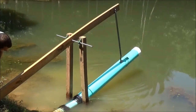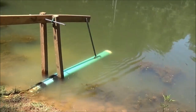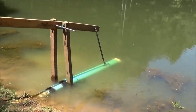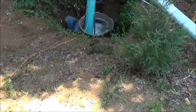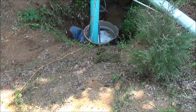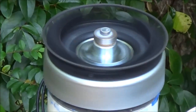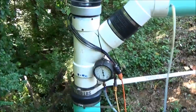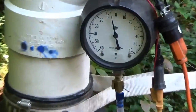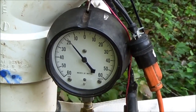Alright, let's get her started. I'm going to lower our gizmo in — just got to push in a little bit and it'll start pulling air, and it just pulled down. When it pulls down like that, the siphon has begun and the turbine will start up. You get a ton of air, of course, a lot of pipe, and the speed's increasing. I don't know if you can hear the increase in sound — we don't have a full siphon yet. You know when the siphon fully develops is when it really starts sucking on the tail end.